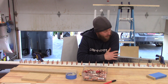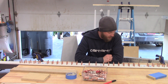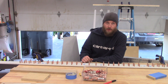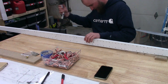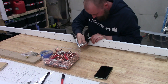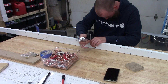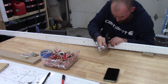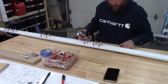That completes the first round of riveting. Now I can take out all the clecos — I'll leave some near the hinge points to keep even pressure across the spar doubler and the spar. Making good progress; it's quite enjoyable to be finally riveting after all the prep work. Just for kicks, I did a little math: riveting up to this point has made up less than ten percent of the build time. Riveting the components to skins will drive that number up, but you definitely spend more time on match drilling, deburring, and other processes.